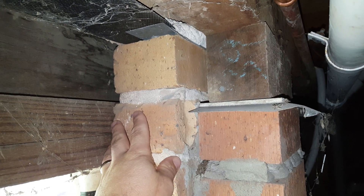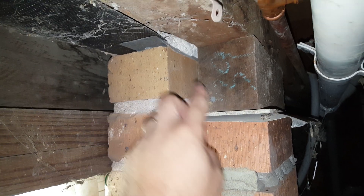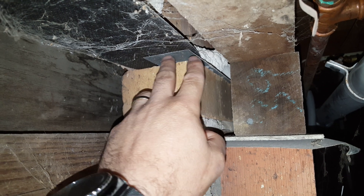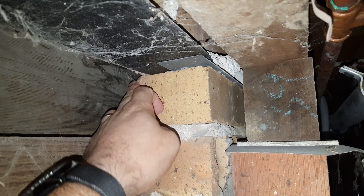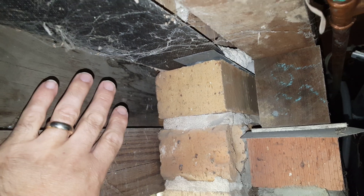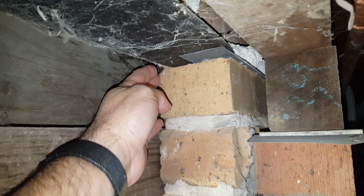This upper cap is designed to protect the structure from termites coming up through this wall, so the lower cap should be connected to it. Another fault is that this particular ant cap does not go the full width of the brick — it should really go to the face of the brick. And then of course we have this veranda structure which covers up the potential inspection edge.